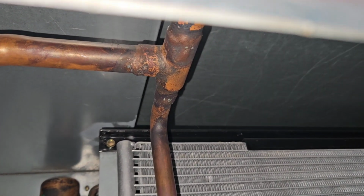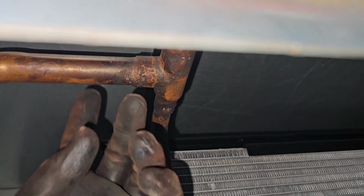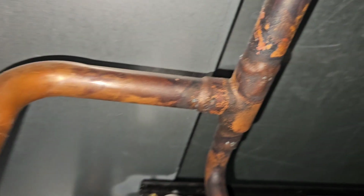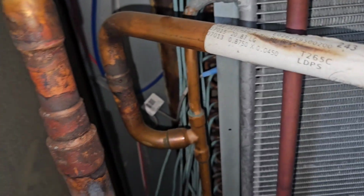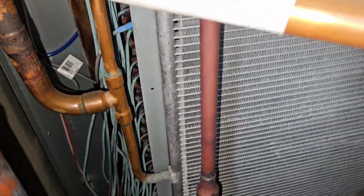Or it'll come up and it ties in right there. So this is out of your reheat coil. This is from your liquid line from the outdoor condensers, if you will, right? So you're in reheat mode, you're gonna make liquid. It's gonna come back into there, get fed into the expansion valve just like it would if this was no reheat. Down into the distributor and normal air conditioning.